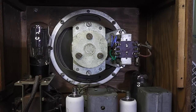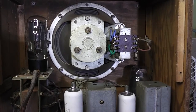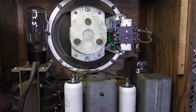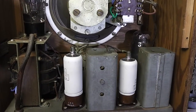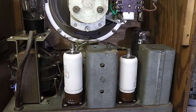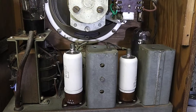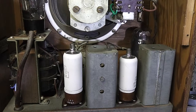Let's have a look inside the receiver. Here we can see a large permanent magnet loudspeaker. Going down, you can see that the rectifier valve is situated on top of the transformer, and that's a very meaty looking transformer for the task in hand. The receiver has four valves, so it's a short superhet.